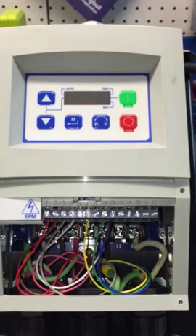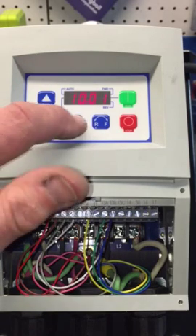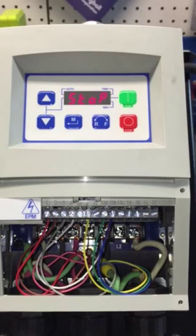On our unit we have a gear reduction happening — the motor has a 22-tooth sprocket and the driven sprocket is 64 tooth. So we use a value of 10.01, which gives us the correct final RPM of the heads that drive the diamond segments. This thing is done — it's completely programmed.